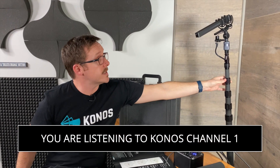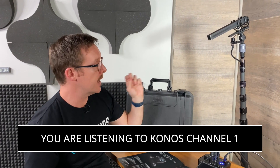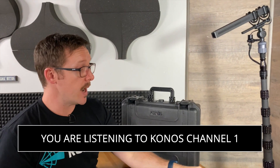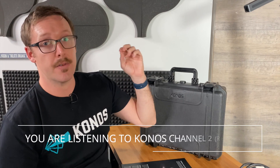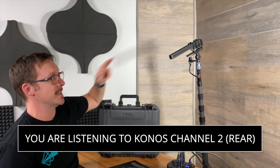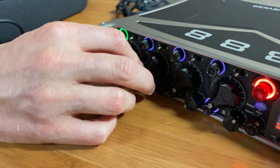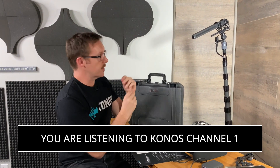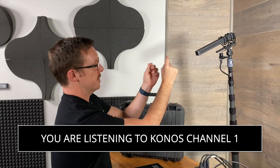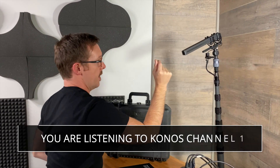You'll notice the way I've got this set up here — I'm speaking into kind of a wall, so a very reflective space around me. You'll hear my voice coming through on a tight pattern through channel one. But if I was to flick that around and listen to the rear channel, you're going to be able to hear the reflective environment — hearing my voice bounce into that back wall coming through. So that's what we're dealing with, knocking out those reflections. And there you've got the front of the microphone again. You can hear the directionality here on this tight pattern. Test, test one, two. You can just hear that really sharp roll-off.